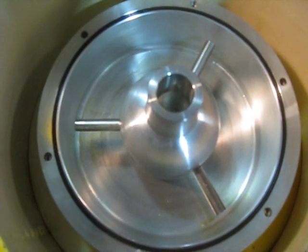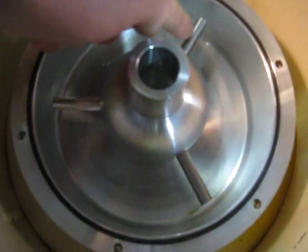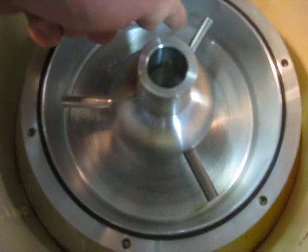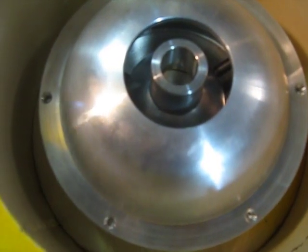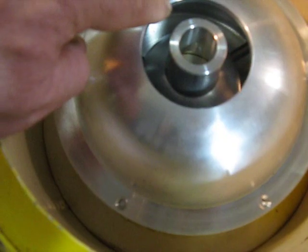In the new feed cone bowl, the oil enters down the center of the feed cone and exits out the feed tubes near the wall. Then it has to travel from the wall back to the cone lid and exit. The cone lid is in place, showing that the oil needs to travel from about out here all the way to this and exit over the top.